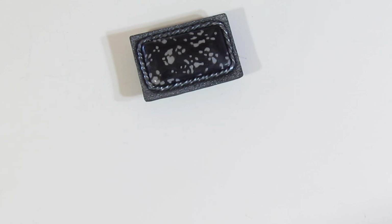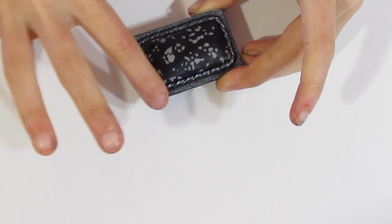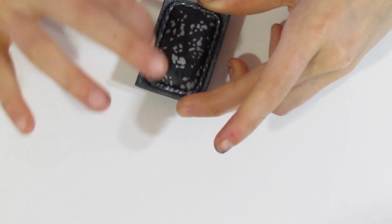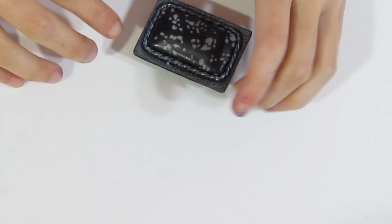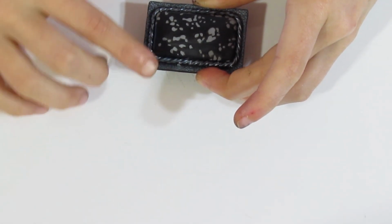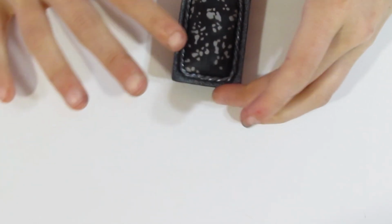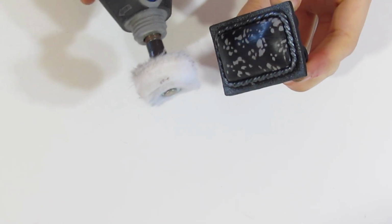And here's what the Renaissance wax looks like. So I'm just going to grab a little bit of that, don't need too much. I'm just going to rub that over the surface, the whole thing. And you don't want too much because wax clogs up textures and things like that. So just gently brush it on. Okay. Then we're going to need a buffing tool. And I'm going to hold it from the bale at the back and I'm going to give it a good buff.